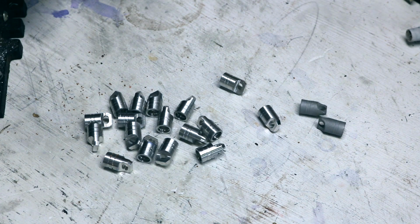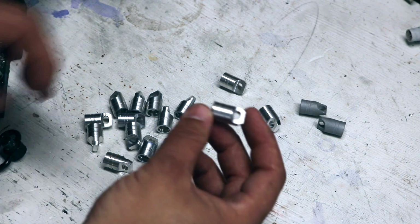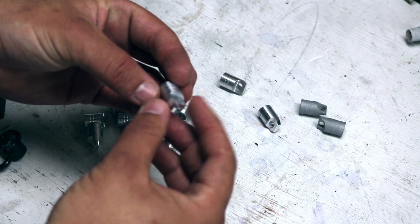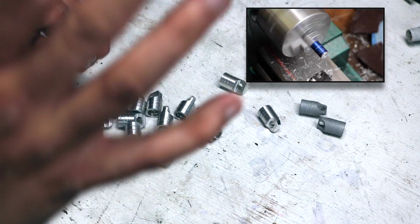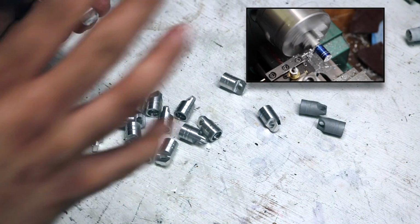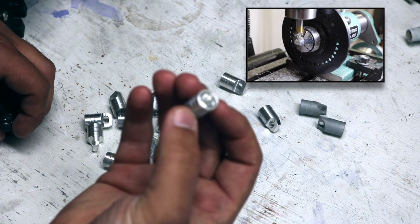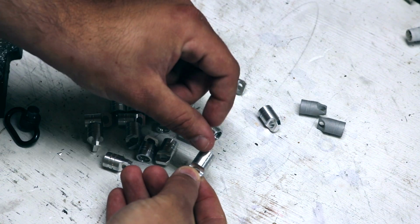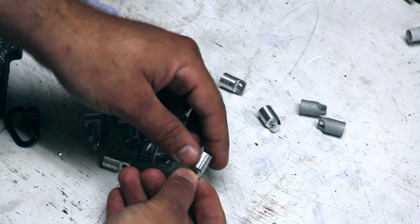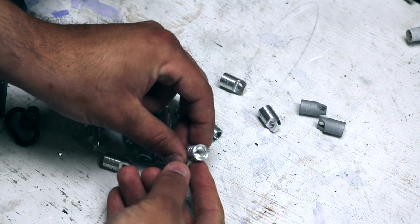Now, one of the things I've been working on, you may recognize, are these QD adapters for a lanyard loop for binoculars, cameras, keychains, things of that. If you're not familiar, I've got a video you can check out. I'll put the link somewhere here as well as in the description. But this is a socket, and the difference between this and the video is that this is now an all-in-one device. I'm not putting the Uncle Mike's QD metal cups on here. Instead, I'm actually just machining them out of the aluminum.